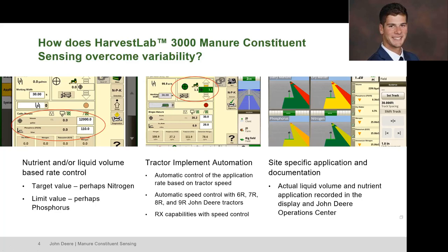Manure is very variable coming from a slurry pit or lagoon, and depending on whether the custom operator has agitated the pit, those nutrient values can vary coming through the pipe. This technology is helping customers and applicators determine the value of the manure almost in real time so they can get as-applied maps and confidently put down a flat rate — say 120 pounds of nitrogen as their target. In the past, without NIR technology, they might only pull one or two samples from a pit covering maybe a million gallons, so this really helps them better understand the nutrient content of their manure.